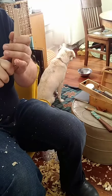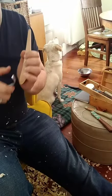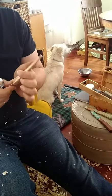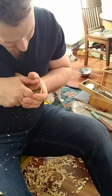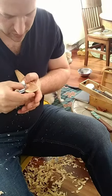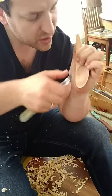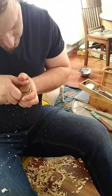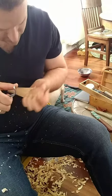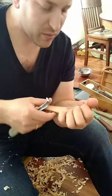Okay, so now that I've got the inside of the bowl, I have as few knife marks as I can, and I've tested the feel and adjusted the feel as well as I can. The other thing that remains to be done are just the final chamfers around the bowl itself. So I like to do the chamfer that's just on the inner edge with the hook knife itself because you don't run the risk of having it cut into the wood on the inside because the tip is naturally lifted up out of the way.